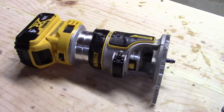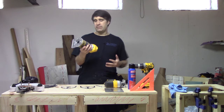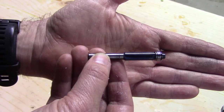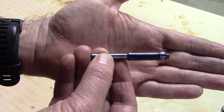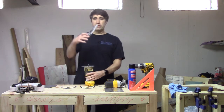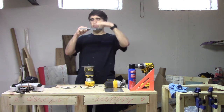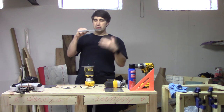Now we get to the magic here, which is this cordless router. You can use any kind of handheld router — cordless tools are kind of convenient. The real trick here is what's called a flush trim bit. The flush trim bit is a router bit that has a cutting piece at the top and a bearing at the bottom. This is designed such that nothing smaller than the diameter of the bearing will get removed during the cutting process. The bearing is going to run along the thick frame and remove any material that is outside the frame on something above it, so your aluminum piece rests on top and the cutting bit removes everything wider than the area of the frame it's currently attached to.